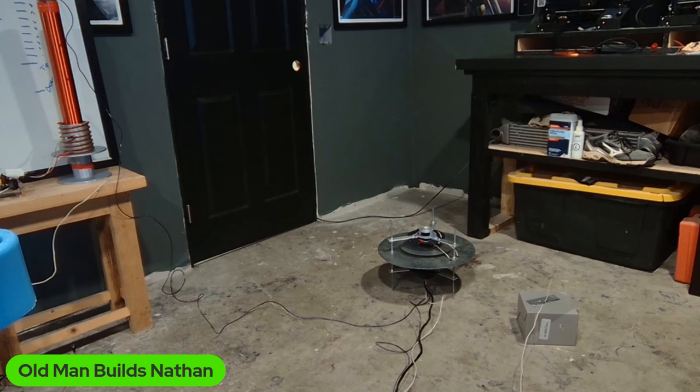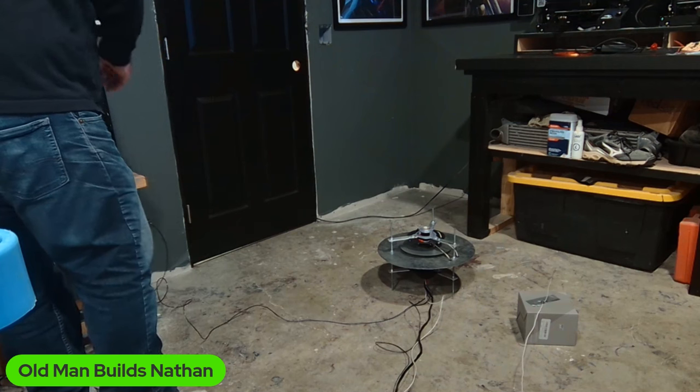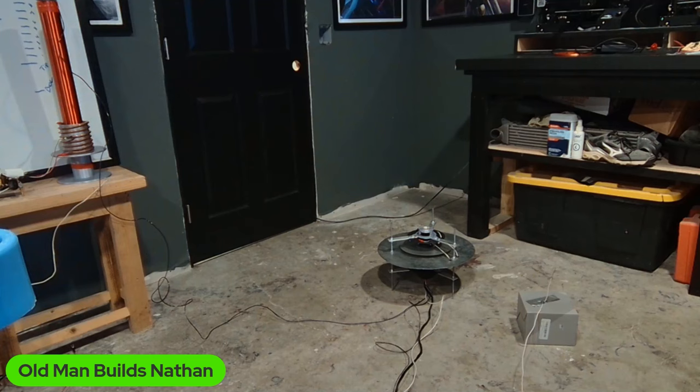You know, I had a little time yesterday to kind of look through the Tesla coil, to kind of figure some stuff out. I just printed off these STLs for the piezo, so that was this morning. It's just kind of a long ride. I have good luck with this circuit about heating up and stuff. I wish my phone would have worked because I got a little heat thing that tells you exactly how hot the MOSFETs are getting. I think 116 was as high as I got them, and that was around 40-something volts, so that's not very much in that Tesla coil, but it seems to put out a good signal at that. All right, a few more minutes and we'll turn it up the rest of the way.